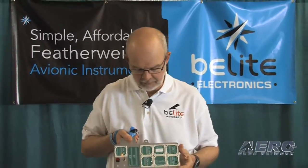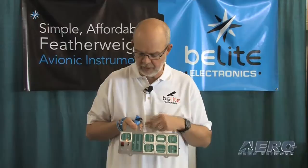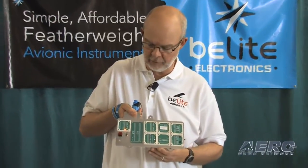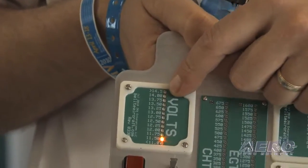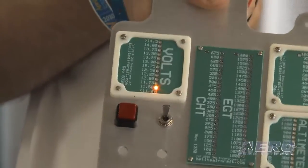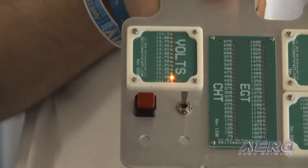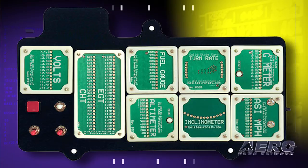This here is a complete panel. It's got eight instruments mounted on it. The only one we've got hooked up here is the volts, and you can see our battery pack right now is giving us 11.5 volts. We've got the voltmeter set up so that if you go too high or too low on your volts, it'll switch from bright yellow to an even brighter red — that way you know you're getting an unacceptable discharge out of your battery, or perhaps you've had a voltage regulator failure. We try and use color wherever we can to indicate a problem or something that needs attention.